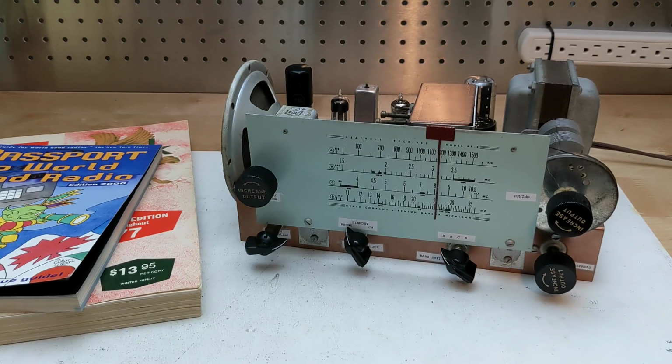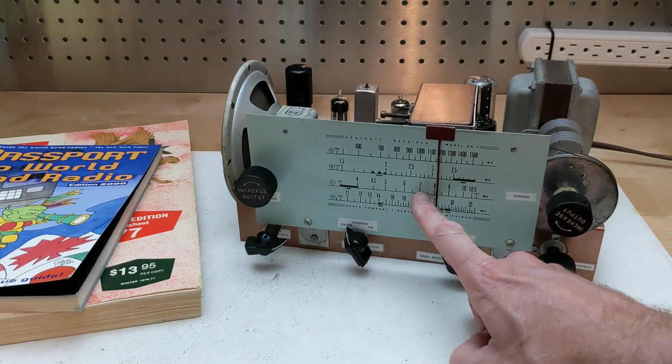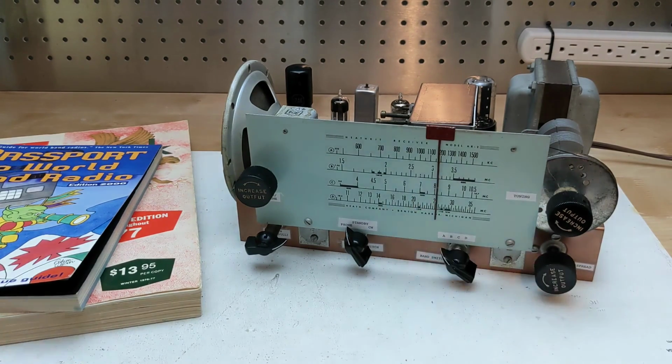This was a basic shortwave receiver suitable for amateur radio use, although tedious to tune without a calibrated band spread and poor selectivity. You can see how small a portion of the dial most of the ham bands took up. The radio was such that a teenager wanting to get into shortwave or ham radio could purchase the kit with money made mowing lawns for a summer, and it was significantly less than a fully assembled radio.